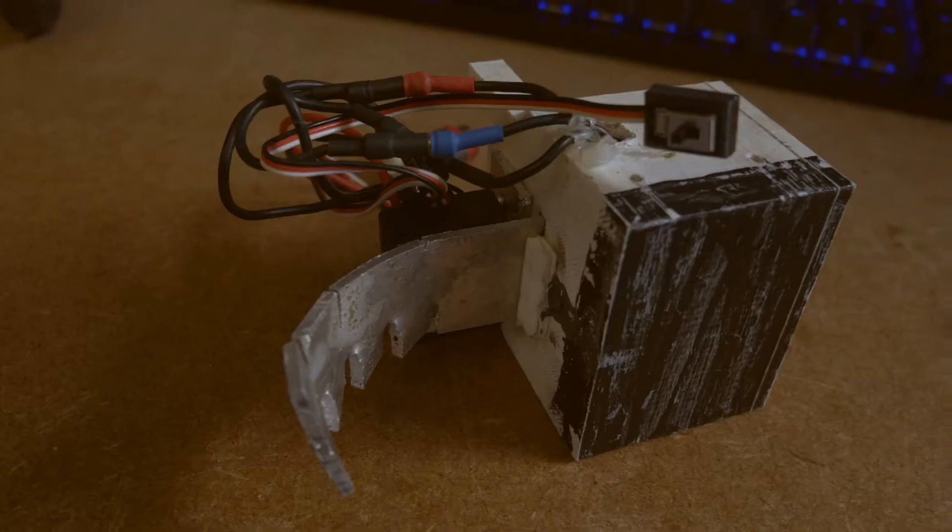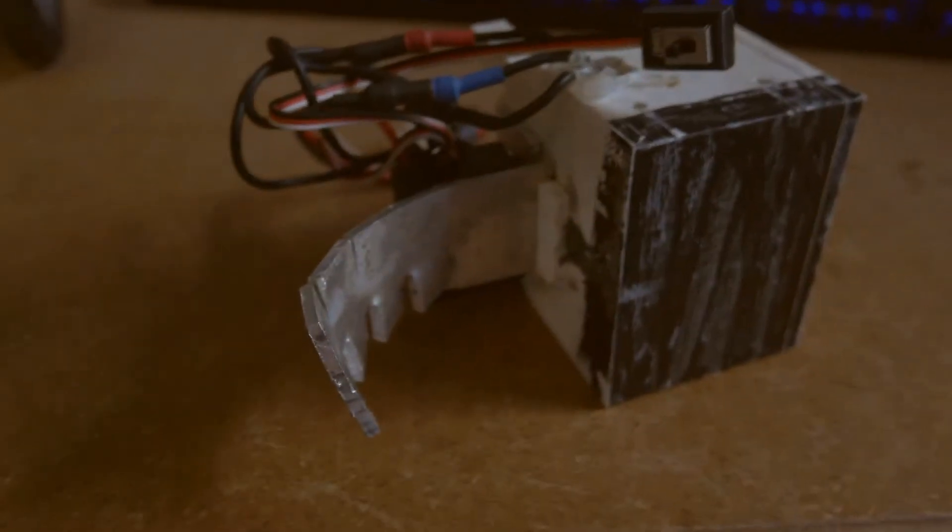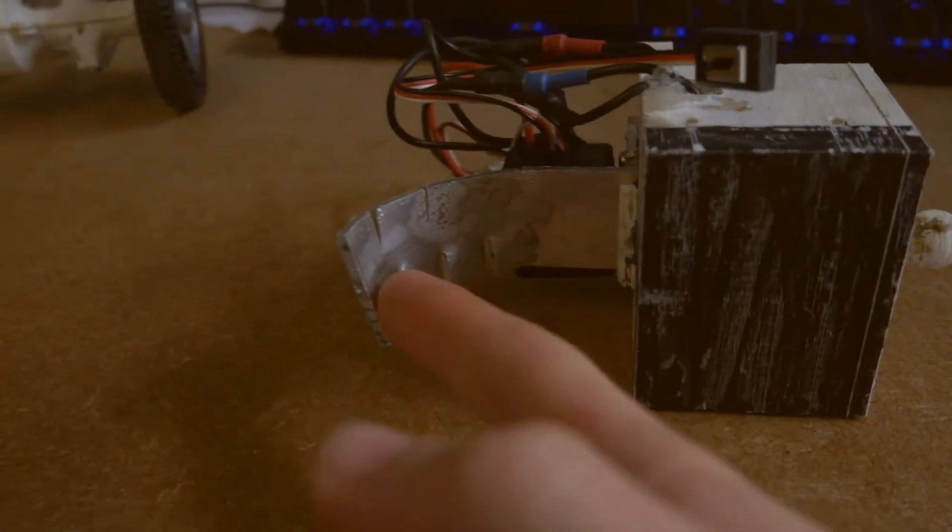That does come out a bit sometimes because there's a blocker place. I've also got this aluminium heatsink. The heatsink is bent down so it goes under, and you've got air going through the grille interacting on the top half and through the ESC fins, and also from under the car on the bottom half. It's also quite thin as you can see, which looks nice.